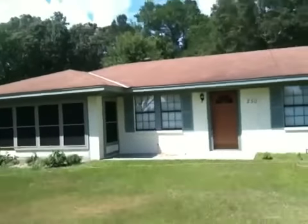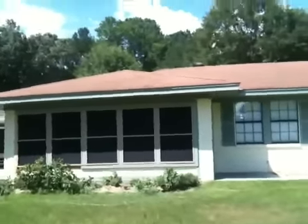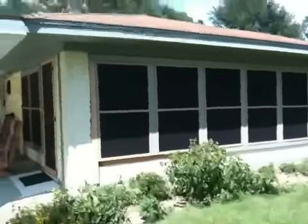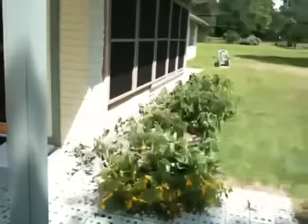There are my screen windows. It took a whole lot longer than I thought it was going to take — it was a little more involved and had to be a little more precise than I expected. I also had some rotted wood here, which is another reason it took so long. I had to replace that, and I still need one more two-by-four. This flower garden being right here meant the wood behind it got a little rotted on both ends. But yeah, that's going to make a huge difference.